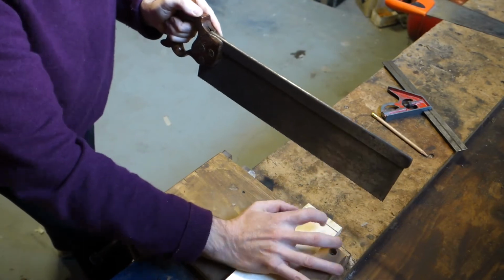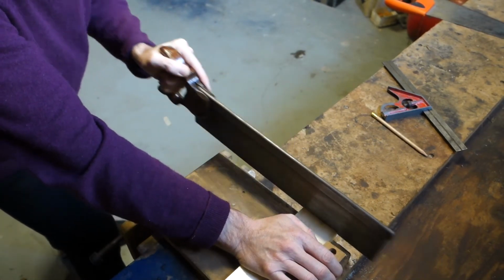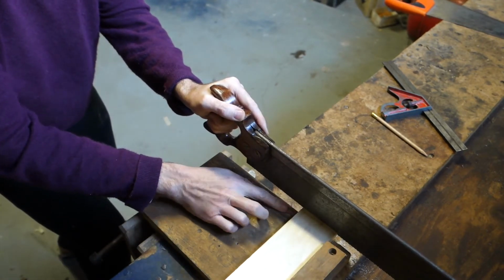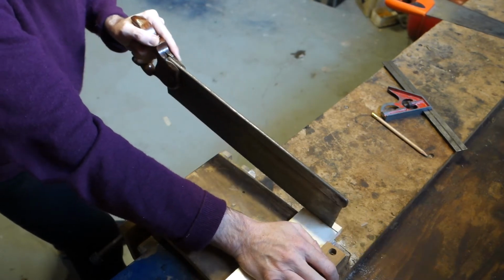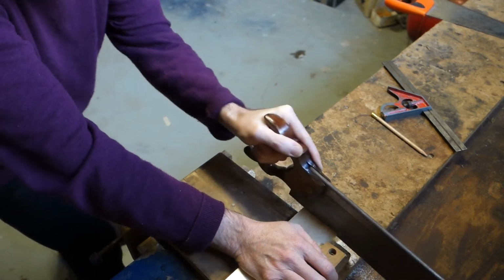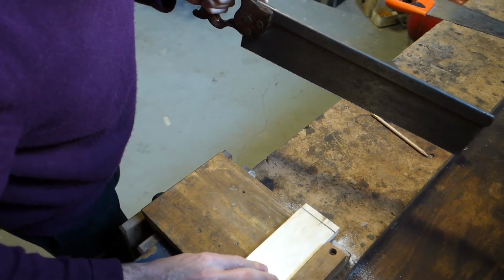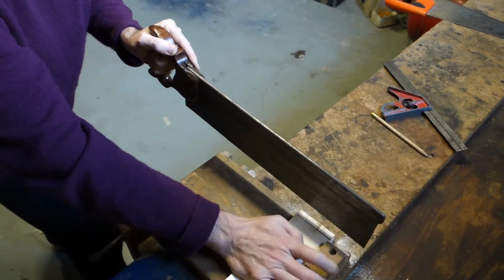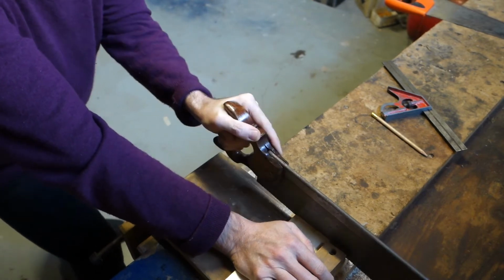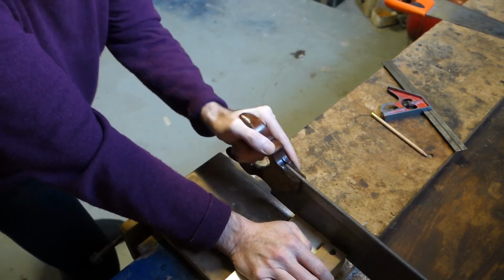And what you can see is you go all the way across, you've made the first line, and then you can just cut it, and follow the line on the front edge there, and just keep going parallel. Perfect, just keep on following the line. If you have a look on the other side, you should see you're following the line, it's not far away. And this is the advantage of always being on the one side of the line or the other, because then you can plane it and get it absolutely down to what you want. So here we go.